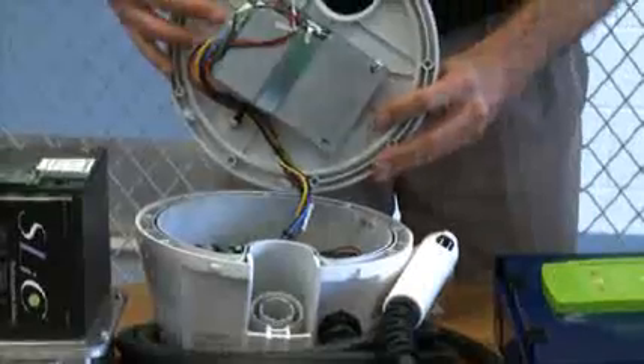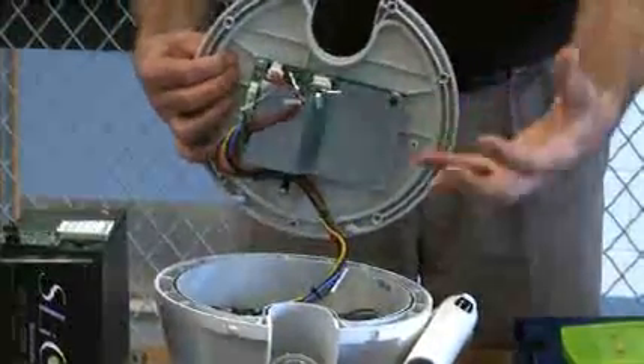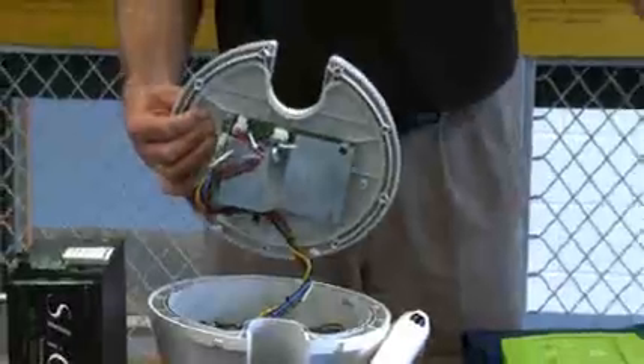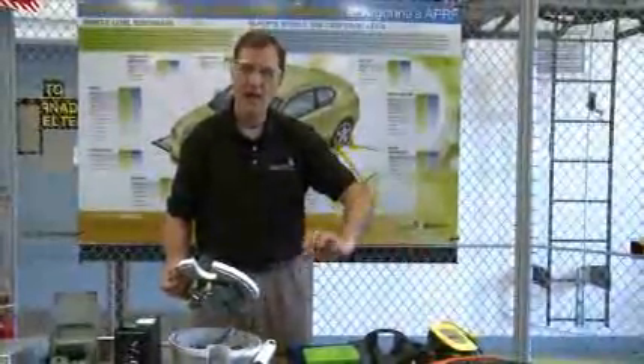The power feed can come in from the bottom or from the rear depending on how things are mounted. It has an O-ring on the front to seal it. As you can see, not much electronics inside for all the safety interlocks. These are non-intelligent charge stations which do not have an RFID or other way of doing billing, so these are direct on-off.